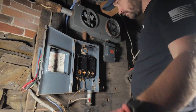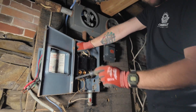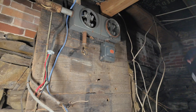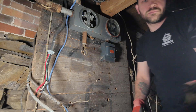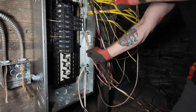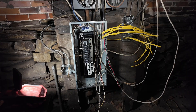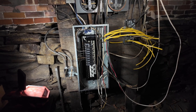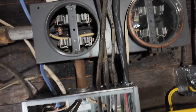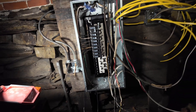Luckily the supply house was close by and they brought me the 30-space breaker panel, which you'll see in a minute. I did use some polaris taps to extend the feed onto the breaker delicately - I almost just slammed that on my foot. There's that old Romex - it just disperses this crazy dust, nasty stuff. I had a mask on for a lot of this part of it. That whole top portion there is all going to slowly get upgraded.